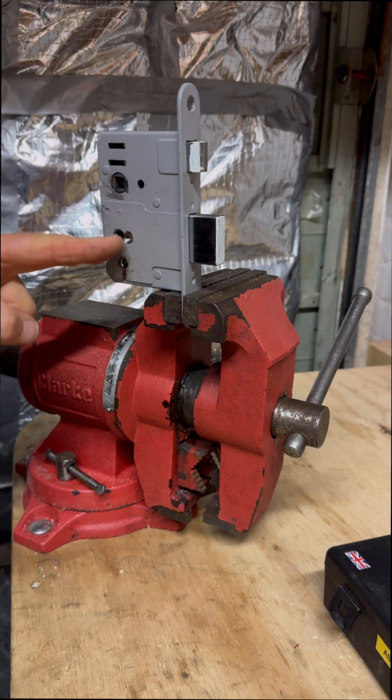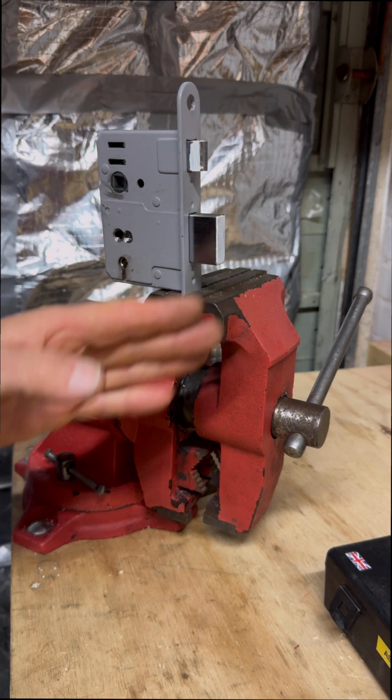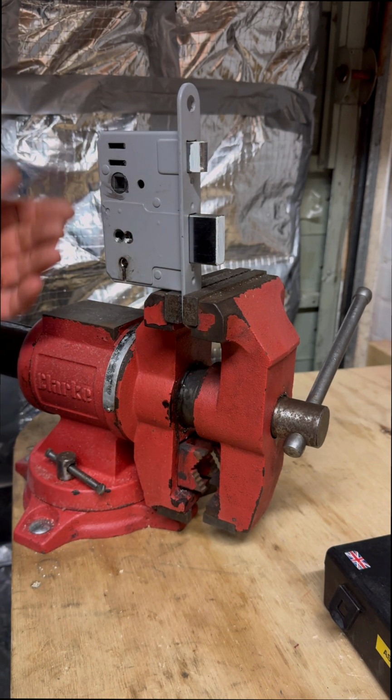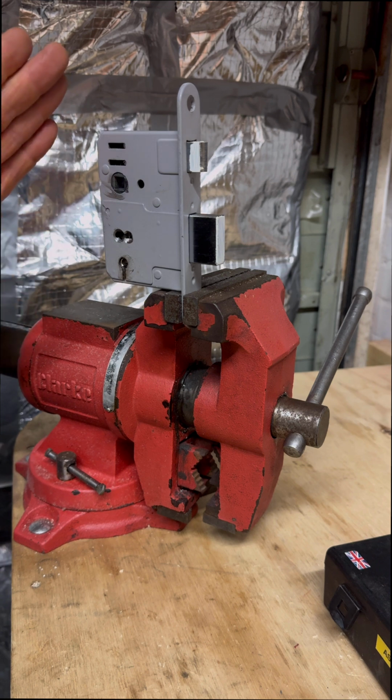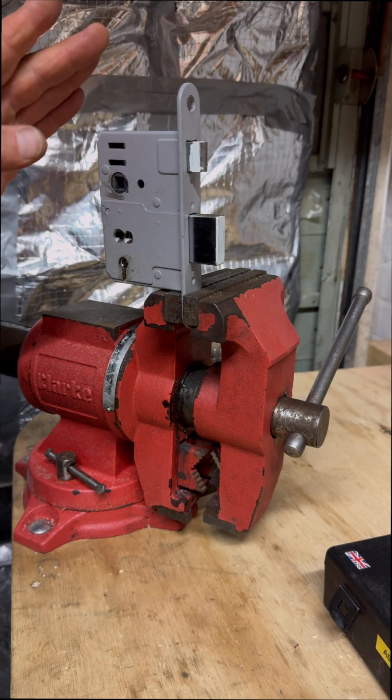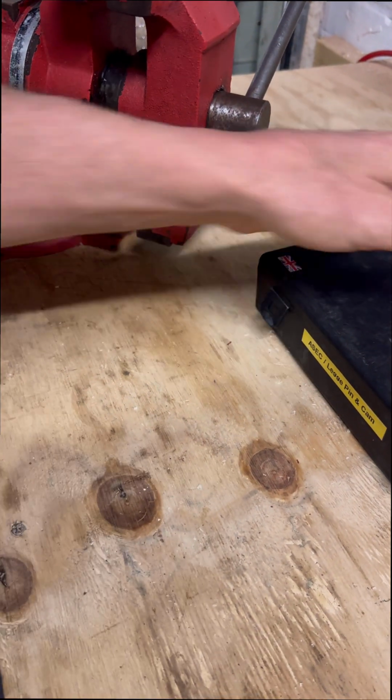to avoid this. Although, to be fair, out of all the locks that you can drill on a door on the right, this is probably one of the easier ones because of where the actual drill position goes. So what I'm going to do is quickly talk through opening this, and we're going to use the pin and cam kit. So I'm just going to put that